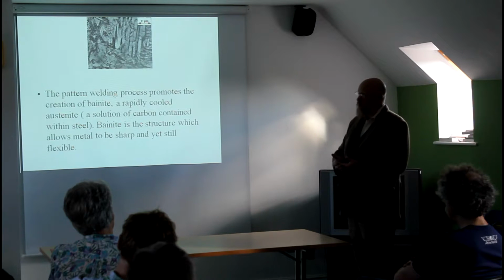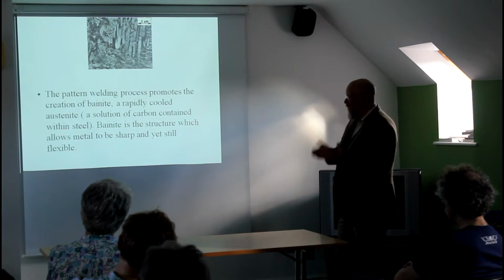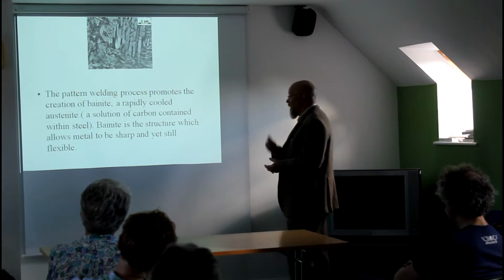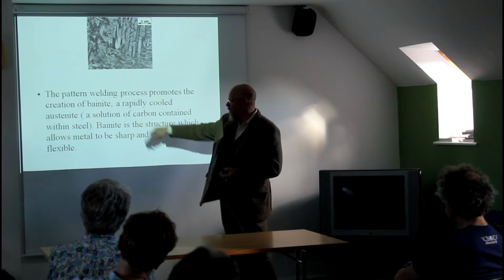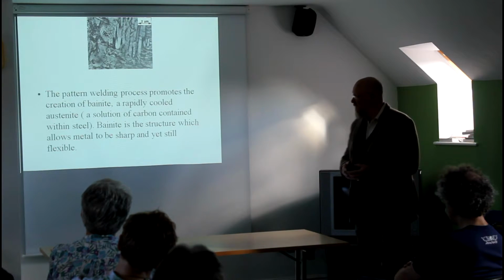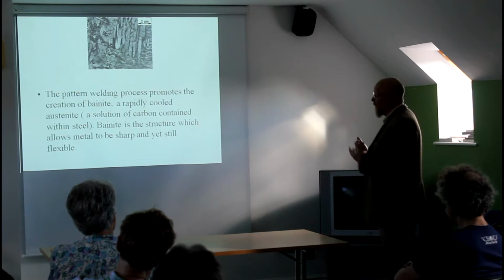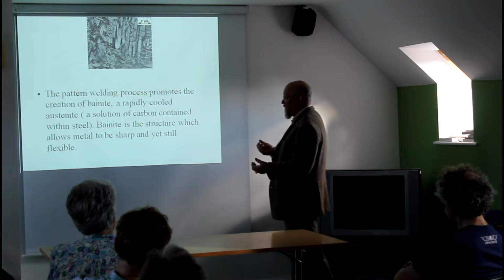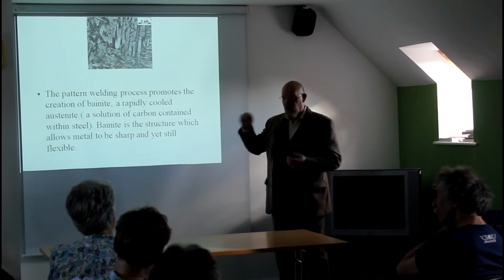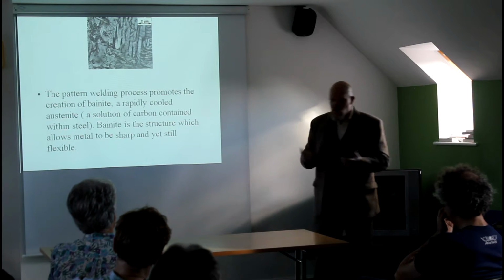So it's a continuous process that you have to concentrate on all the time for up to, I think, about 1,000 hours probably to make a blade for a sword. And all of these things, what we call bainite now. Bainite was only identified in, I think, 1929. And so these people obviously don't know what bainite is. They don't know that they're promoting pearlite growth or austenite, but they know how to make good swords. So a lot of things we've identified and given names to now, they're doing perfectly well 1,500 years ago, and doing a lot better than we can, to be honest.